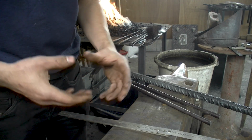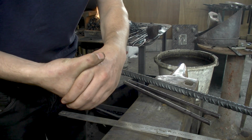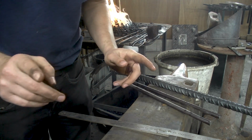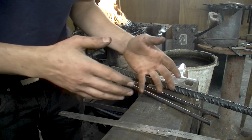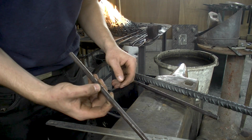In one of my recent videos, Philip Ponsela demonstrated the double cleft weld in order to do the weld that actually keeps itself together. Another version, of course, is the scarf weld, you put together and then you forge that out. That is how typically tongs are made. You scarf weld on a pair of reins. I want to do the application with the double cleft weld: weld on reins to a pair of tongs.